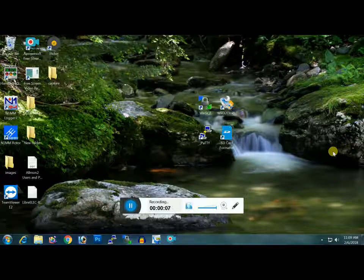We're going to do a complete first run install as well as Supermon and macros on the latest Crompton image. The first thing you want to do is get yourself a Class 10 micro SD card. Probably any old Class 10 will work. I tend to use the Extreme Class 10s. 8 gigabytes is plenty adequate. I've used 16. No need to run a huge card on this.